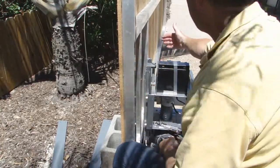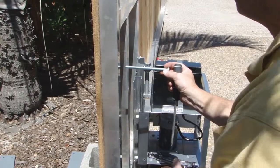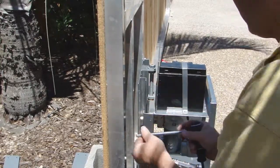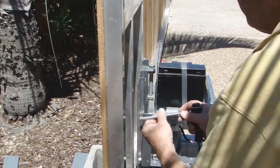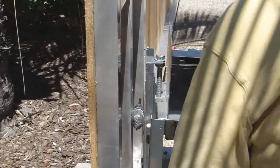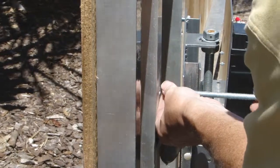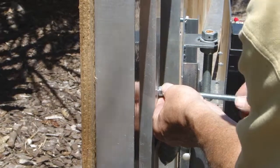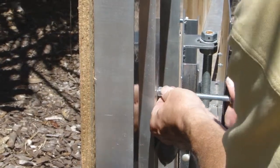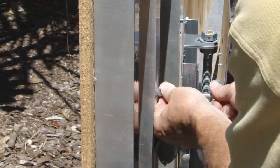What we've done is we've mounted the two bolts on the inside already of the Gator Power Gate, so the Gator is on the gate now. We ended up having to use five and a half inch three-eighths bolts to give us enough angle as we go through the gate as well. So we're going to use three bolts, three nuts, and a five and a half inch three-eighths. We're going to prop this open a little bit, and as I put this through, I'm going to run a few bolts on the inside here, which will allow me to get the adjustment and the angle I'm looking for.